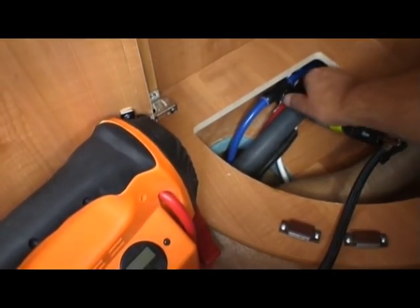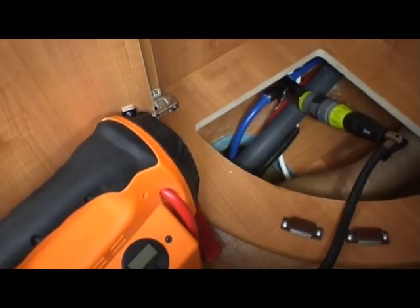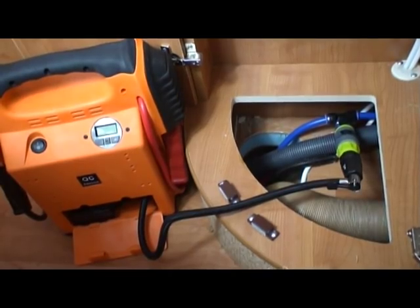Now, you may remember whenever we fitted the T adapter, we had left it in the off position, again for everyday use, so that water could just travel past it and onto the taps and the shower, etc. What we want to do now that Floe is connected and the compressor is connected is put that to the on position. So now that the system is sealed, what we want to do is connect up our compressor. And as you can see here, we've fitted the airline to Floe. So now that everything is connected, we're now ready to carry out our first drain down.